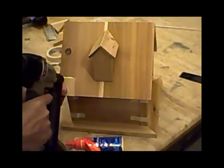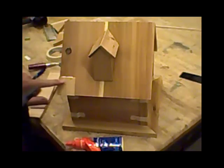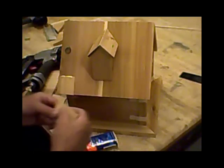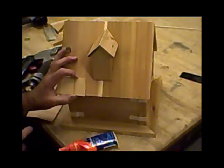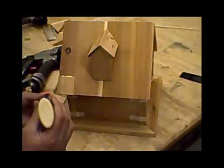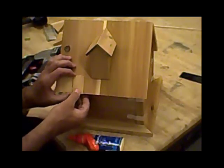Line your shingle up, push it in there, and just give it a light pull on the trigger. Notice how high the staples are. Now we do that with a couple of different pieces of shingling. You notice we're starting to get kind of close, so I'm going to break off a smaller shingle this time. When I mount this one, even though it was the piece that originally hooked to this one so the lines match perfectly, I'm going to leave just a little bit of a separation so that you can actually see the joint. Get the exact same amount of overlap — don't vary it, get it exactly the same.